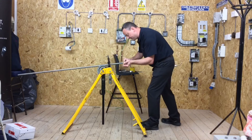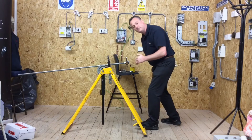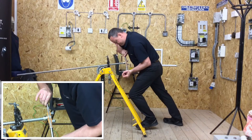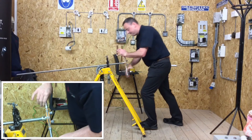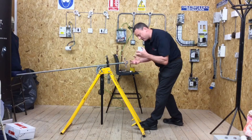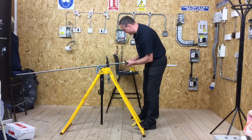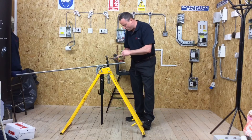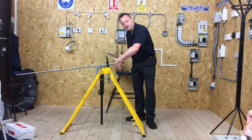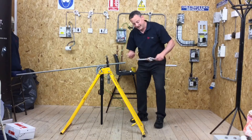Make sure it's nice and tight. It's a small motion — I'm going to apply lots of pressure with a tiny motion as I go. Once it has bitten onto the steel conduit and I've started the thread, I take the die off and apply my cutting compound. I just need a bit on the end — around the tip where I'm cutting the thread. The compound goes on the actual end, the tip of the conduit.